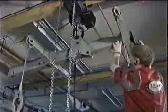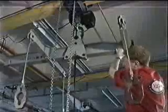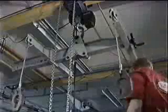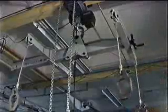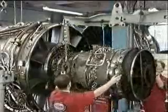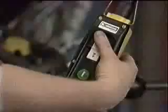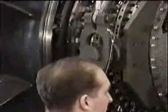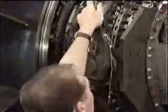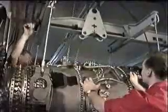Now the lifting sling can be put into position. With the sling suspended by the crane, turn the adjustment wheel until the sling is balanced. Carefully move the sling into position. Connect the cables to the outer trunnions at all 4 lift points and adjust the height of the sling to take up the cable slack. Turn the adjustment handle to find the correct center of gravity position.